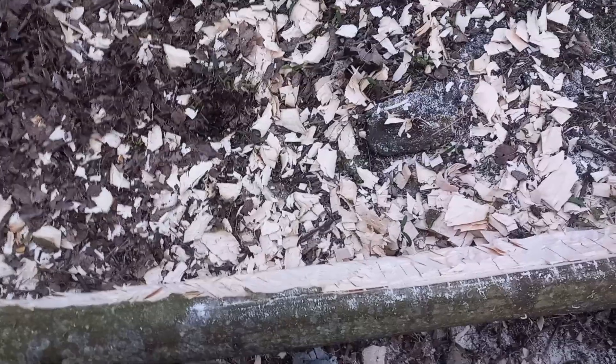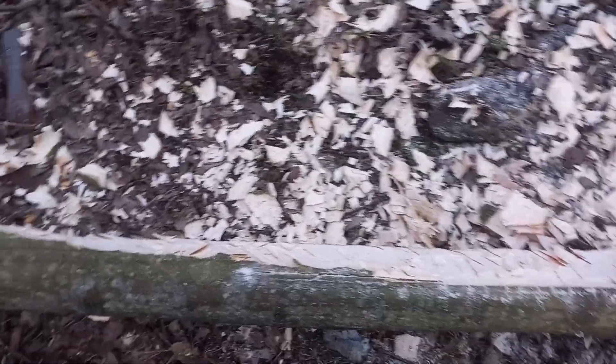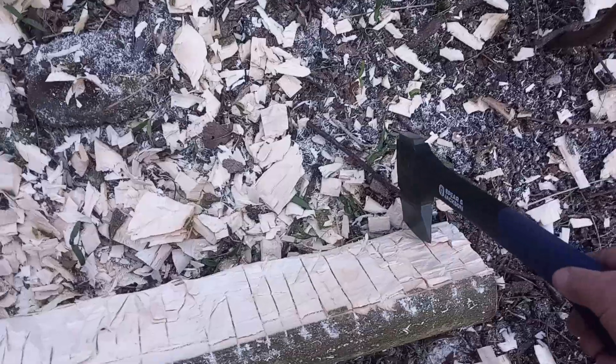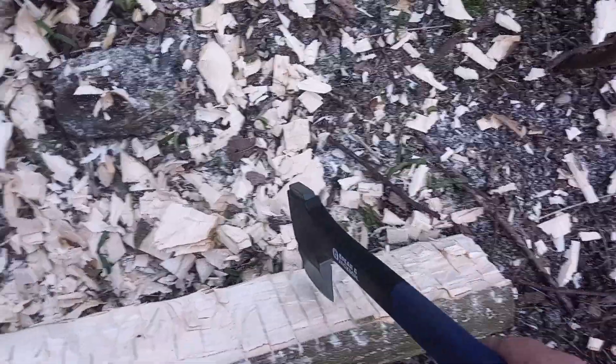The other day I stripped off the side of the log to let it breathe a bit and lose moisture. I possibly should be more patient, but I'm not, and I need to press on with processing this wood. So what I did is I came back and made saw cuts across here at frequent intervals.